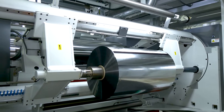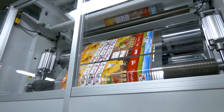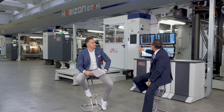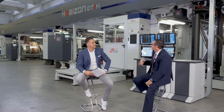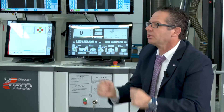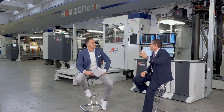We're going to take a 48-gauge, which is 12 microns, PET — polyester — which is actually printed, and we're going to laminate a MET-PET with that — metalized. We apply the adhesive on the metalized side and laminate the PET with that product in the first station. Once that's done, it goes through the semi-flotation dryer. Then it goes into the second gravure station, where we apply a secondary adhesive and laminate low-density polyethylene at approximately 50 microns. The result is PET laminated to a metalized PET laminated to a low-density polyethylene.